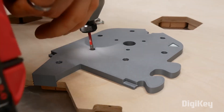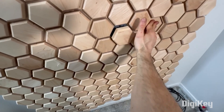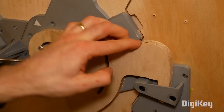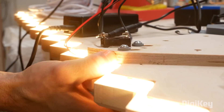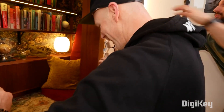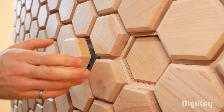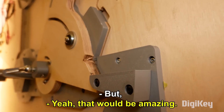With the door installed, you press in on two of the hexagons to have two others pop out. Rotating the popped-out hexagons 60 degrees releases the two locking mechanisms — a deadbolt and a latch. One additional hexagon on the edge of the door can be slid outwards, which activates an LED strip run around the perimeter of the door. With the catches released, the doors can be slid open revealing the library behind. The secret door, which otherwise looks like an interesting piece of wall art, puts it on a whole new level — a fantastic project and a great video to document it.